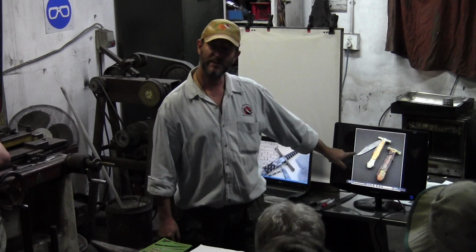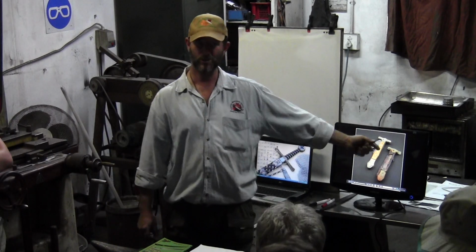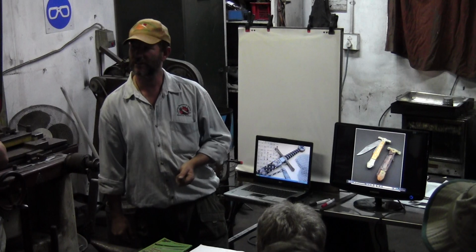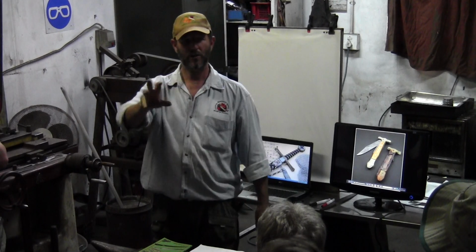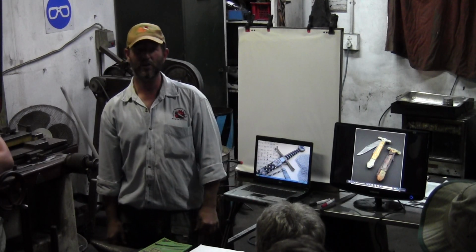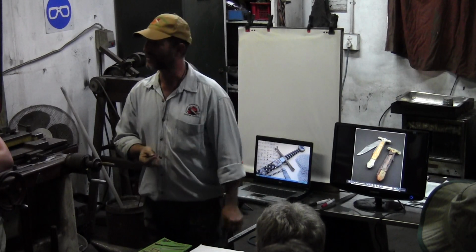These guys, I mean, in the States we've seen guys who will bury these knives in coarse salt, for example, dampen the coarse salt, and let it get pit holes. There's a technique that they call the mustard finish. Have any of you heard of that? It's hot dog sauce, mellow and mild or something, with vinegar and salt and other stuff. You put dabs of mellow and mild mustard over your nicely polished blade, allow it to rust up a little bit, rub it off with some fine steel wool, and do it again, and you give it a natural patina. It looks like an old thing.